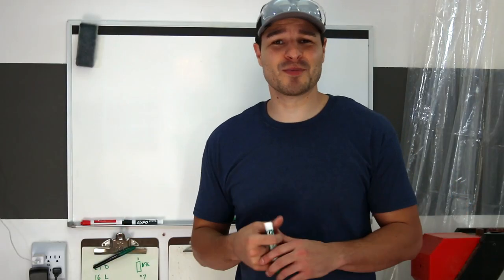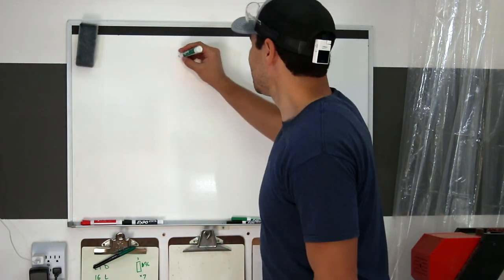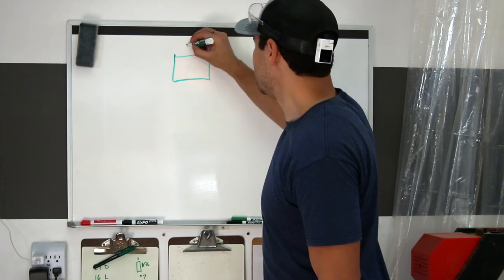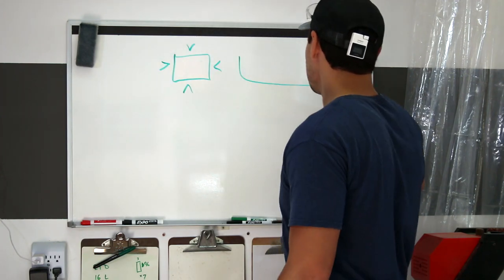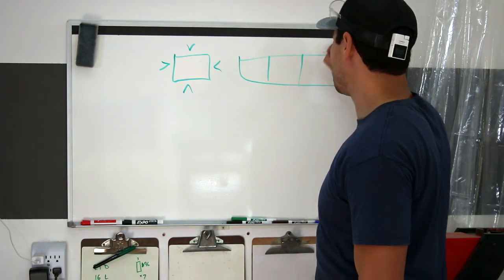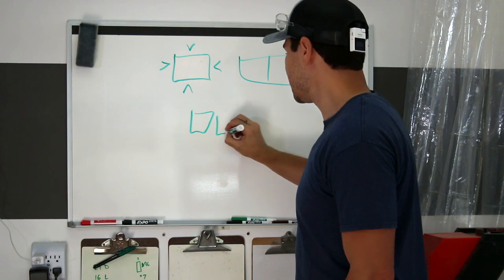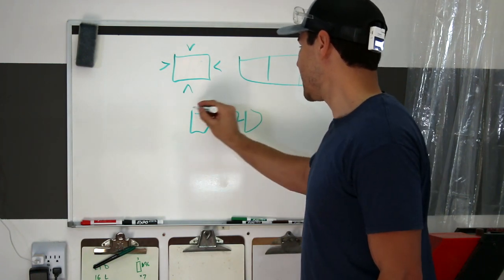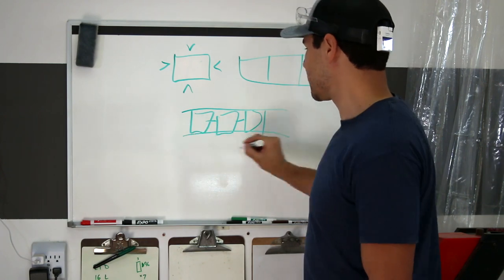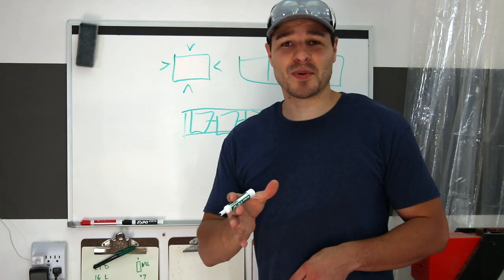Since I like to experiment when I'm working on the shop, we're going to try to do this backwards. So normally, you would take your material and surface all 4 sides. That way, when you have a glue up, they all line up perfectly. I'm going to try to take these janky, warped boards and glue them all up together, and then try to surface the sides after and see if we can get a flat bench top. This is not the proper way to do this.